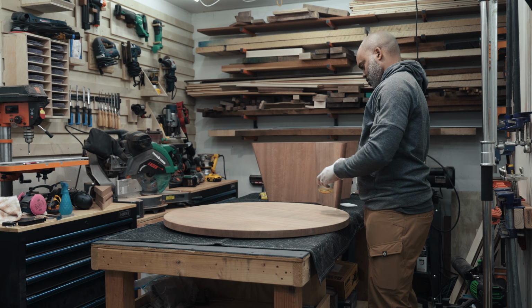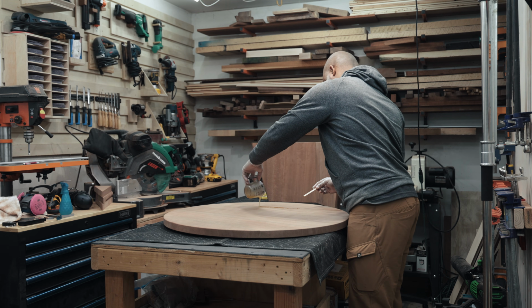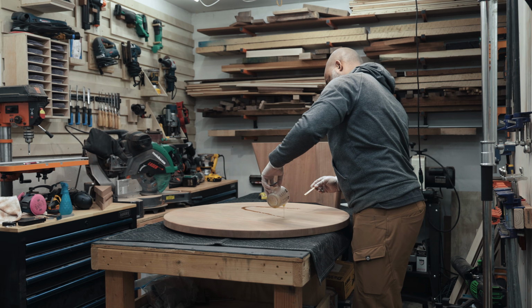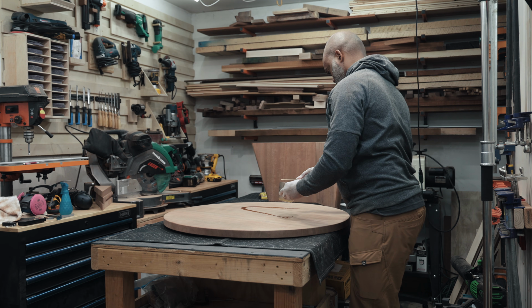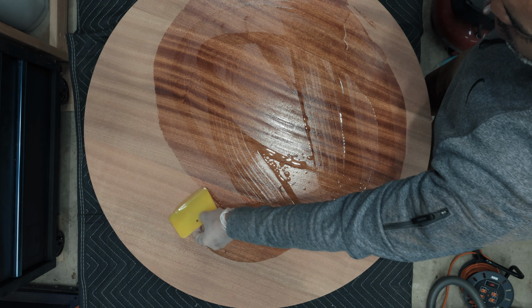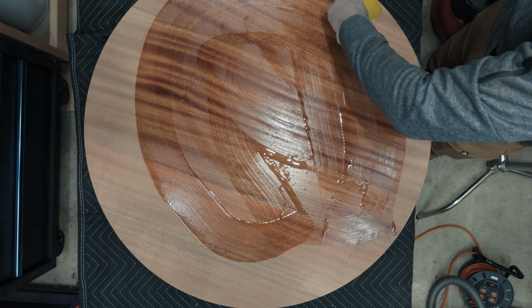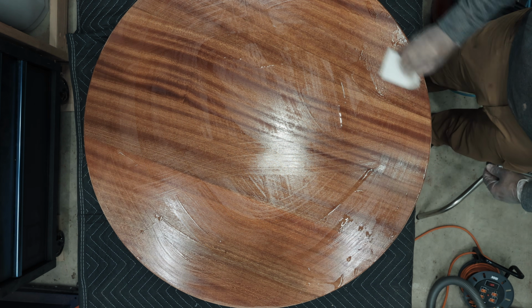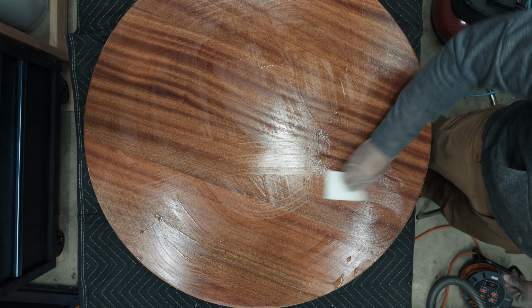After sanding everything to 180 grit, raising the grain with water, and then sanding again, now I'm ready for the finish. And for the finish, I'm using something that I've never used before, and that's Natura One Coat. It's a 2-part hard wax oil similar to Rubio Monocoat, and spoiler alert, it looks great. And double spoiler alert, despite the name, it is not a one-coat finish. This stuff looks like Rubio, it even smells like Rubio. And despite both their names, neither one of them is a one-coat finish. They both look dramatically better with the second coat.